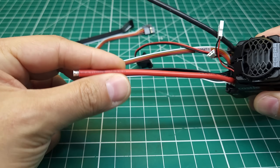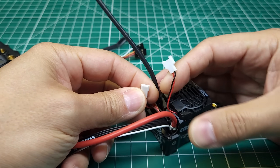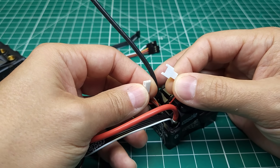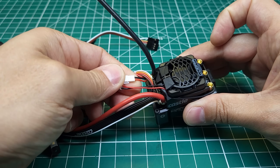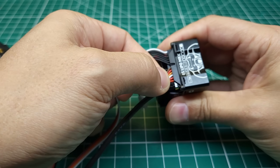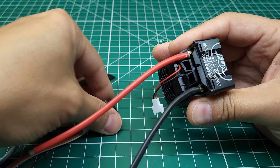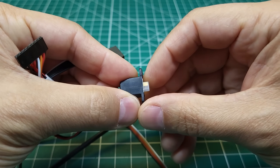You can see here we've got Castle branded 12 gauge input wiring. We do have the proprietary Castle connector for their fan. I think it would be a good idea for them to move on to a more generic style connector, so if people want to upgrade the fans they don't have to worry about this connector — but you can always replace it on this end as well. As with most Castle ESCs, both the main power cable and the sensor cable are replaceable. We do have the classic Castle switch here.